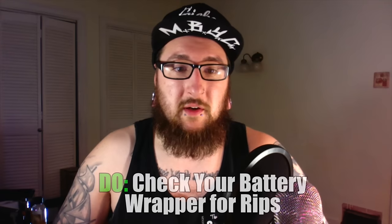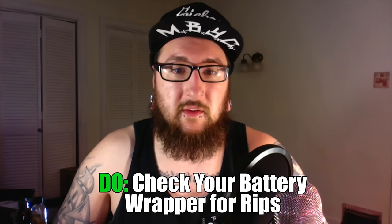Don't risk using a battery that you've shorted out — a $15 battery is definitely not worth risking your hand over. Always check your battery wrappers for rips. This is a common problem that is all too often overlooked. I've seen countless customers come into my vape shop with tears in their battery wrappers who think it's not a big deal — but they are definitely wrong. Even if it's a minor tear, you should always rewrap it, because if it's left untreated it could get larger or possibly short your battery and cause you to get shocked. Battery rewraps are cheap and easy: simply peel the old wrapper off, slide the new one over, trim if necessary, and heat it using a hair dryer — presto, you're ready to vape again.